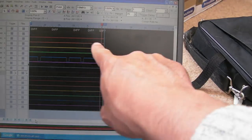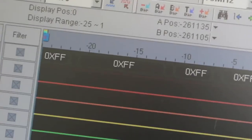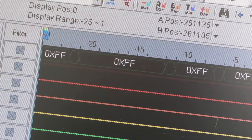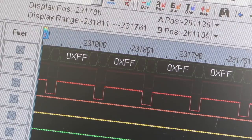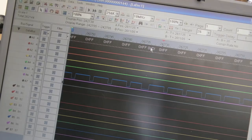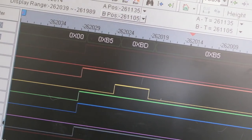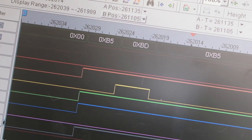After all those FFs — doing a capture without any ROMs in there, with no ROMs whatsoever. Right from the very start we get: 00, B5, BD, then B5, 00, FF again, and then it just loops around. That makes me think the CPU is continuously resetting — or something else is outputting onto the bus.